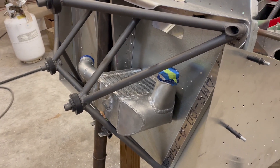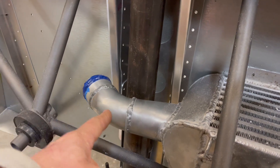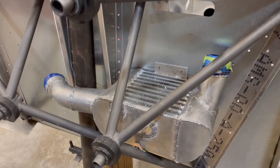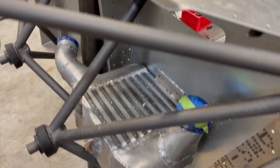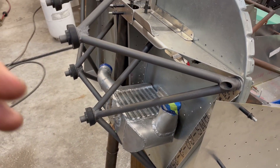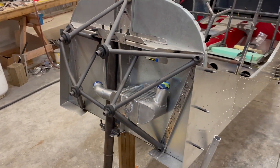You can see the intercooler is tucked in there pretty tightly with the engine mount. This side comes from the turbo — the turbo pushes the air through the intercooler, comes out this side, and it goes through an intake pipe I've got made that comes over and above and into the engine. You'll see that in the next video. One of my struggles is I have to get air through this intercooler to cool off the air that's passing through it for the engine. With it being a rear mount, I'm going to have to make a scoop probably on the top of the cowl. Things are getting just incredibly tight, so I'll try to get a little more mocked up so you can see it a little closer next time.